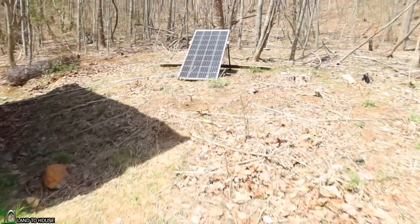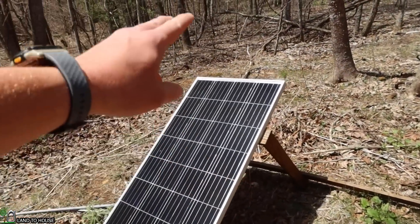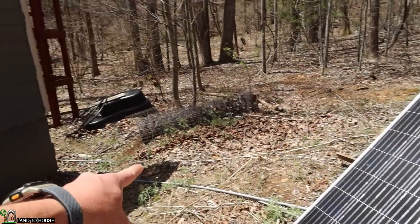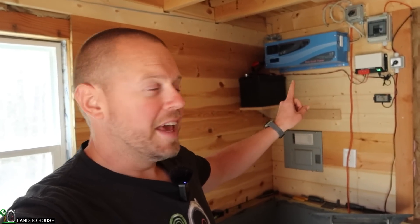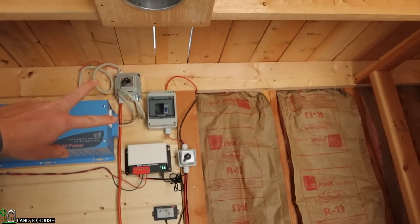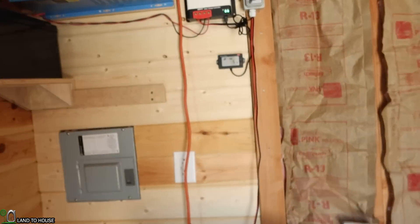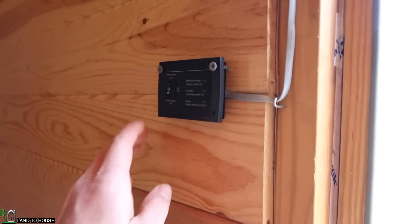The electronics kept the little power shed warm enough not to hurt the batteries, and it seems to stay cool enough back here in the shade that it's no problem in the summer either. That's the update on the house system. Let's move over to the tiny house. This is my tiny house — I'm currently working on finishing it up, but it has a very new solar install. My panel over here is just kind of resting on a little makeshift frame of wood, and it's a 180-watt panel. It brings power in through that piece of conduit over there. Let's go inside and see the electronics. Over here on the back wall, I've got the inverter, the battery, charge controller, and also a couple of switches. I've got 5 watts coming in, and that's basically just keeping the battery topped off at the moment.